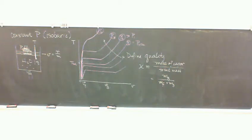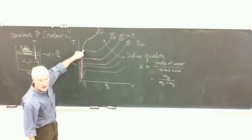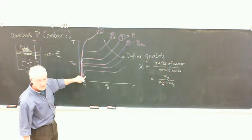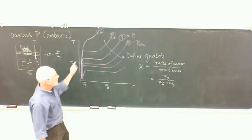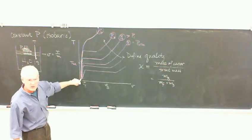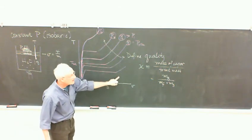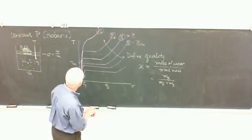Again, the transition from liquid to vapor, or vice versa, depending which way we're going, gets longer, at least longer in terms of the graph, and goes across it. And so now that we've run all of these experiments, and all of these points have something in common, remember what happens at these corners? If we're going that way, that's the last point where it's all liquid. If we're coming the other way, that's the last point where there's any vapor. That's the saturated liquid point. These are the saturated vapor points,